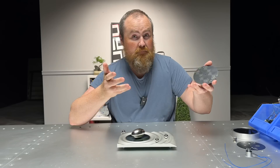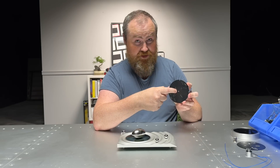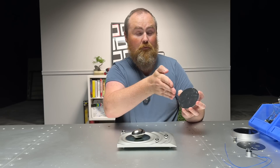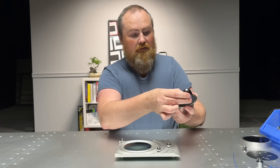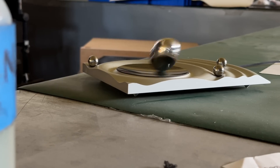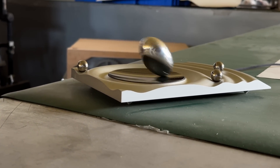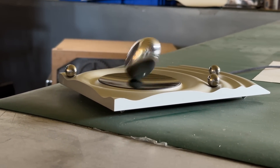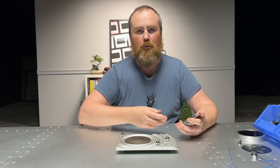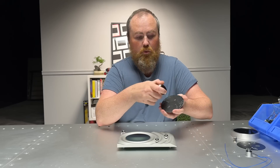Now the interesting thing is this is a brushless motor at this point, but a normal brushless motor has a shaft and a bearing - the magnets are attached to the shaft and when it spins it can't go left, right, forward or back. This egg can - it can go all the way around everywhere. So we need to know where the egg is at all times to fire the electromagnets at the right point. Because if you fire them at the wrong point, it's like pushing a kid on a swing and then punching him in the face - it's just not gonna work.